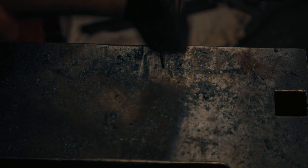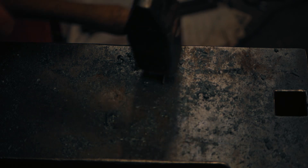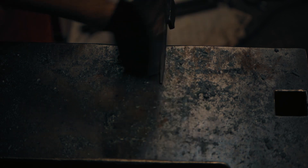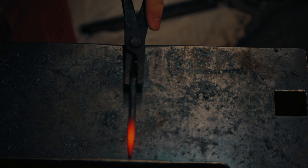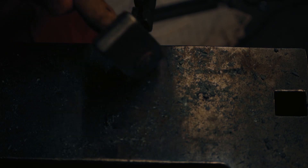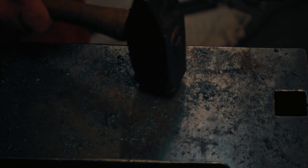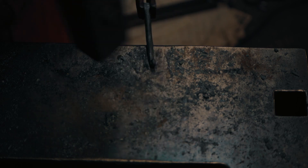And magical heating by the edit process. Now I'm going to curl the tip. Curled tips are a traditional finish — they look good, but mostly they also keep you from catching things on them. And I'm carefully tightening this up. I don't want to squeeze it flat; I just want a nice round curl that touches the stalk where it comes back to me.